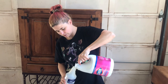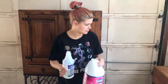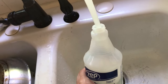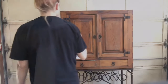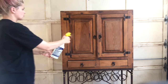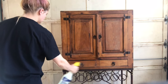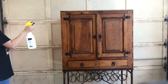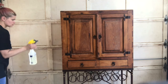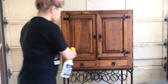It's a good idea to have some towels or paper towels on hand to clean up your messes. When you're spraying the piece, you'll want to spray the entire piece lightly, but you don't want to spray it so much that you have drips coming down — as the bleach dries, those drips are going to be left in the finish. That's another reason why I mix half bleach and half water instead of doing straight bleach.